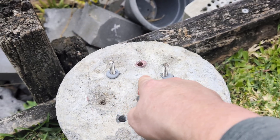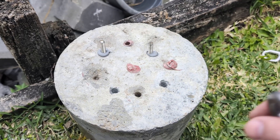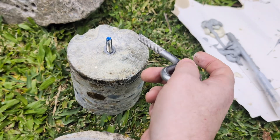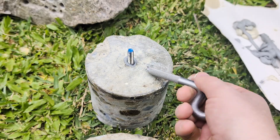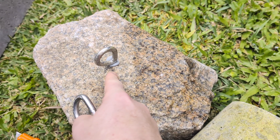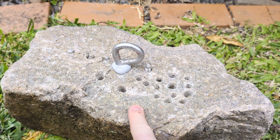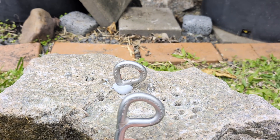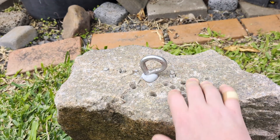We've got a couple of these little studs in this concrete, so that'll match the data set from the big glue testing video previously. I've also got one in just this core sample — I just got this from a core drilling site. If I can score a bunch of these from a core drilling company, might be a convenient way of doing this kind of testing. And then I've got a bigger core sample with a pre-loved Rauma bolt. I've got one in granite — another pre-loved Rauma bolt, but that's just 8mm.